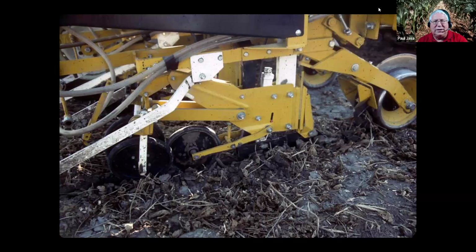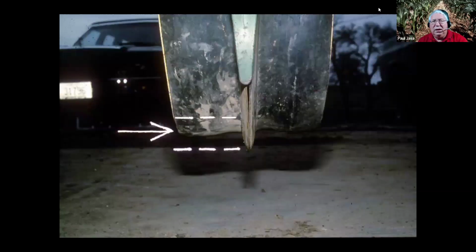Seed to soil contact is a press wheel right on top of the seed. Close the seed V was closing discs or closing wheels in this case, and then a harrow behind, outside the picture, to finish closing that seed V. And again, if you think of those steps, you can evaluate any planter, any drill, any air seeder out there in the market. Where do you need help? If you're going to buy an attachment, will it fix the problem you have, or will it create another problem somewhere else? When it comes to cut or handle residue, I prefer to cut it.